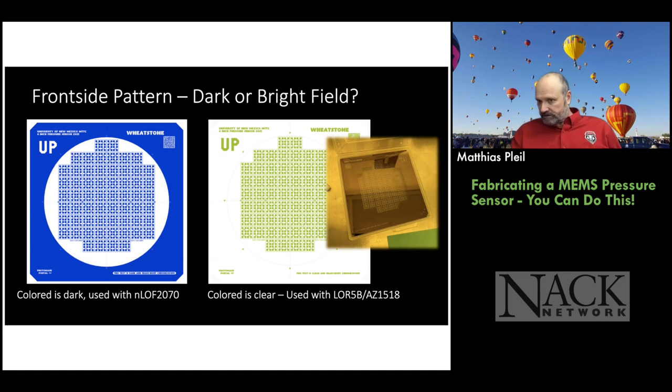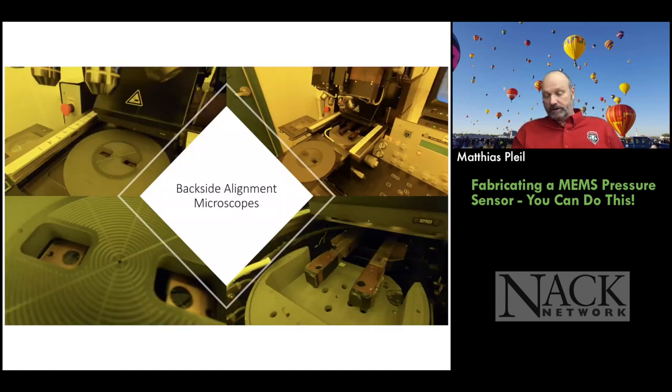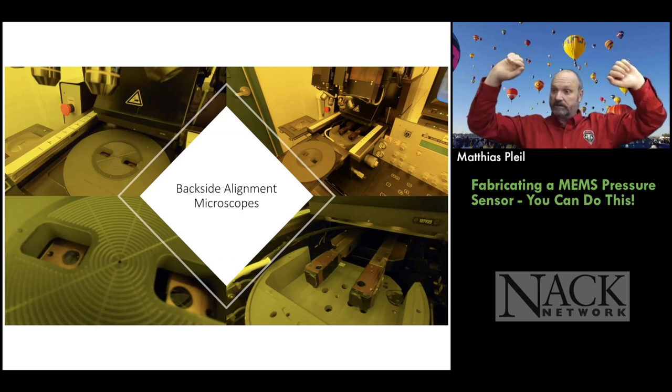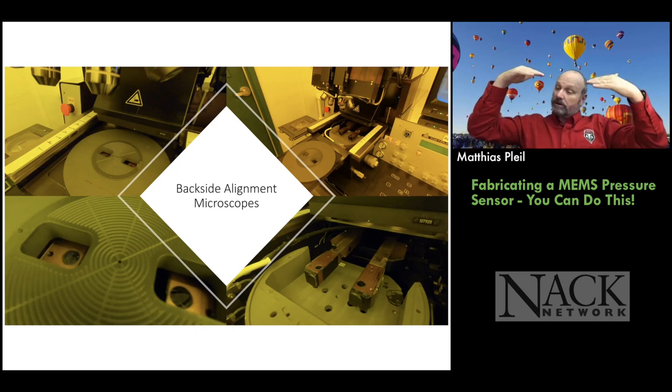And then the opposite is true on the right side. It says that this text is clear. So that means wherever it's colored in, that's actually an open area on the mask. So all the stuff that's white is actually going to be chrome, and all the stuff that's green is going to be clear. Okay. So the mask on the right we use with the positive photoresist. And then again, we use our Karl Suss to do this. So we have to do backside alignment. So we have that pattern on the back of the wafer now because we etched it. We etched that pattern into the silicon nitride. And it has alignment marks on it. But the alignment marks are on the back of the wafer.